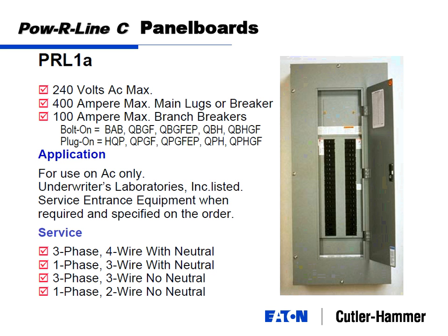We've got plug-ons, which are basically non-existent, because if you've got a panel board with these little 20 amp one pole plug-on breakers, cheaper than a panel board with plug-on breaker is a load center with plug-on breaker. Your commercial, residential and light commercial load center can carry the same ratings as a panel board, but be much smaller and much cheaper. So panel board, we're talking about a commercial installation, medium commercial, light commercial residential.